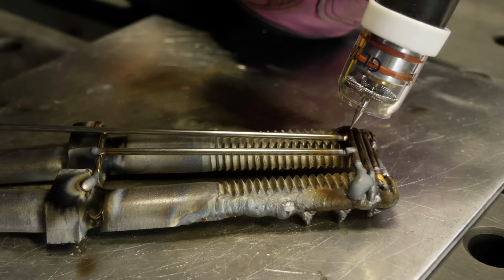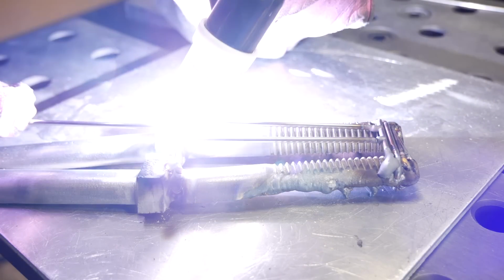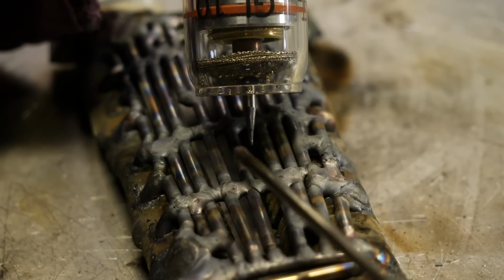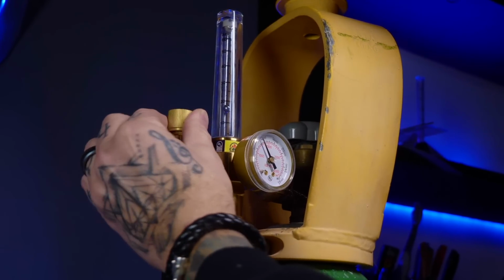But again, I'm gonna build this thing using all different ribs that I am now installing. I'm doing the exact same thing. I'm tacking them in to kind of give it the rough shape so it matches the drawing. I'm doing all of my bridging tacks to put everything together, filling everything in, kind of fusing it as I go. Again, I'm getting a great gray looking oxide. One thing that I actually did was I turned my gas volume down quite a bit.